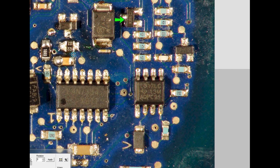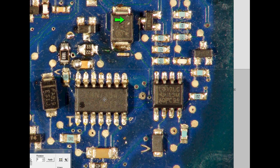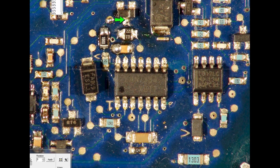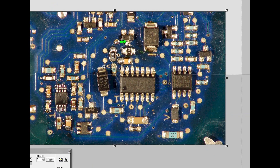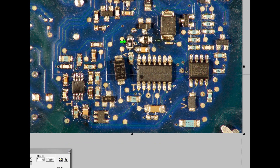You've got the impression of what to check. To recap - just to make sure we're singing from the same hymn sheet - when you're changing the FETs you need to change and at minimum check all of these components we've discussed. That way when you power it up it's got the best chance of working.